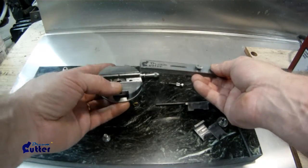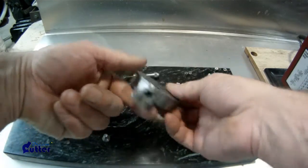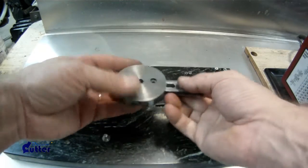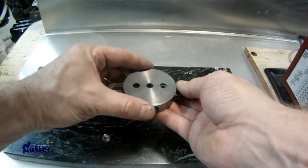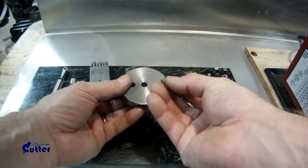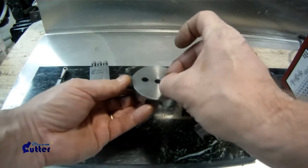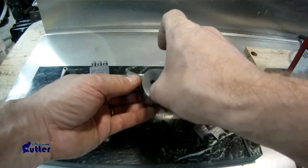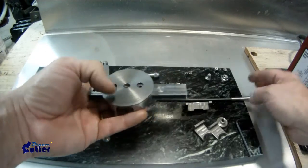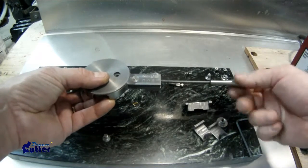This is the main rail, which is used to set the primary pivot point. It's also a dovetail slide — it slides right through the body. You'll notice there's a slot down here and a hole through the base and the body. They line up with this lead nut. There's a flat on the lead nut that lines up with the slot so you can insert it easily — just wiggle it down and it drops into place. Then you can take the lead screw and slide it in.